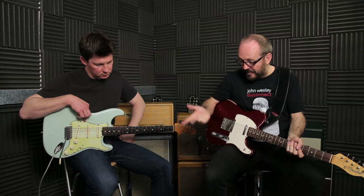So what we've had to do is, because we're reducing the gain of the input, the gain is also reduced at the output. So we increase the gain of the output. So I'll show you how it's done. Okay, standard overdrive pedal.